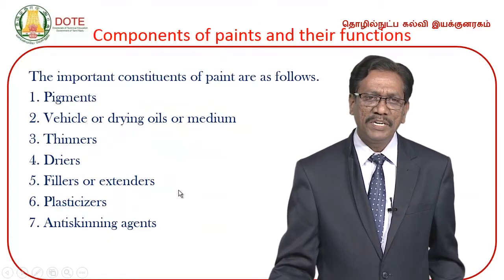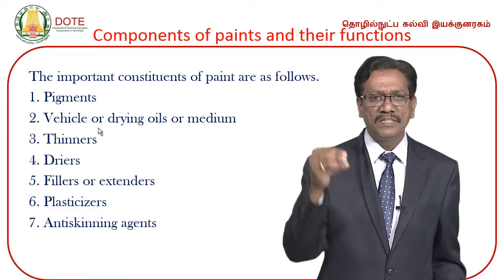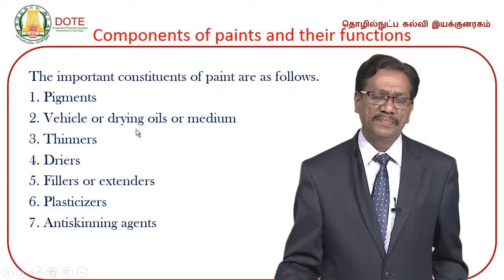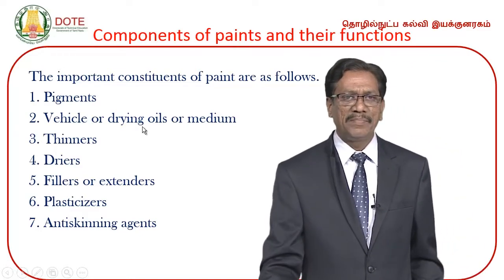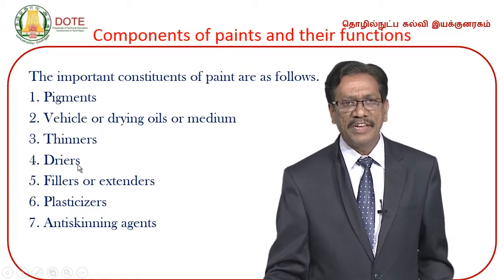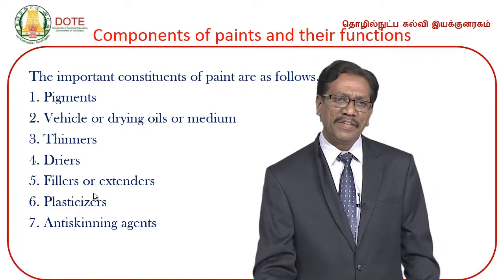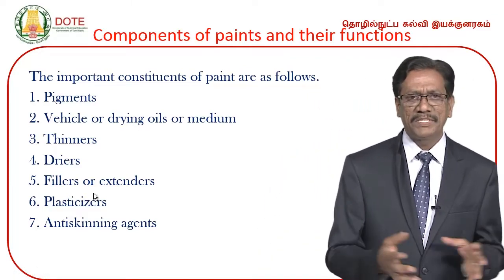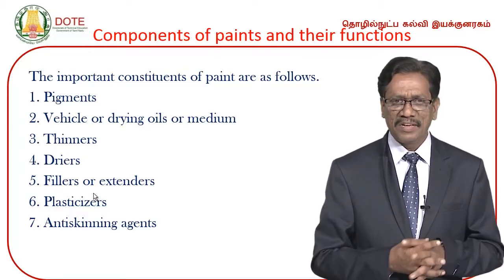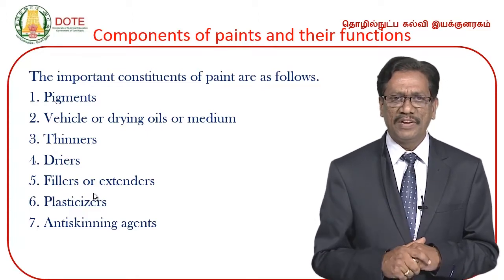What are the components of paint? Paints have a pigment — a color-producing chemical — and a vehicle, which is the medium in which the pigment is dissolved, acting as the carrier. There are also thinners, which help for dilution of the paint, and dryers. Fillers are also used — their purpose is to increase the volume and compensate the cost — price compensation.